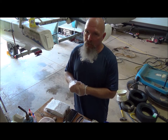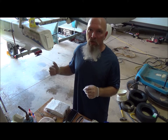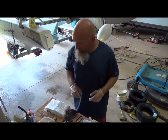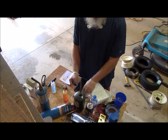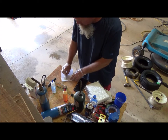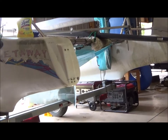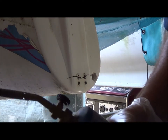I think I've still got plenty of time to deal with it. I'm going to use the compressor with an air gun attachment and try to blow that G-flex deep inside these cracks and see if that helps. Anyway, time to mix some of this stuff up — just using a small amount this go around. I've got some leftover little tiny pieces of kydex that are going to be my working tools on this project. Mix this really well, scrape the cardboard, get it all mixed in there. First thing: touch this polyethylene with the torch to create that oxidization on the plastic.